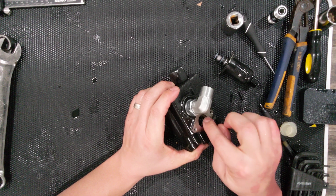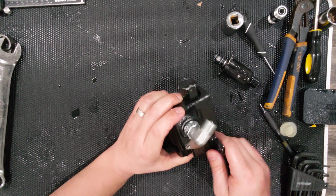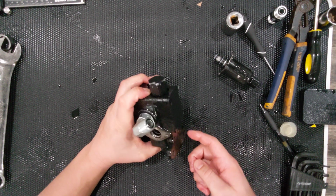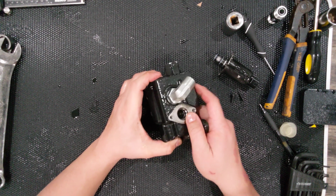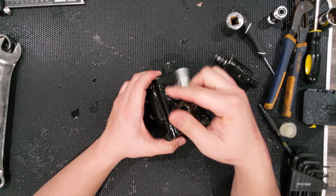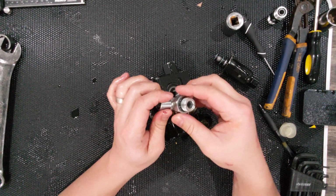And there's a port for oil here that comes in at the high side, which is right here. And then towards the inside, it's probably not something you can see on this camera, but there's a port, and that most likely goes down to this one. I think this one probably supplies oil there. So with this, and I just have this finger tight because I just put it on there, it screws in. Again, this is an O-ring boss, so you'll see it listed as an SAE fitting.